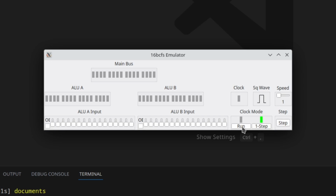All right, Adam, hang on a second. You said that adding latches was bad. Adding registers was bad. Well, yeah, I did. Or at least I implied it. Here's the thing, though. I need to make sure that things happen on the rising edge. And in this case, the state of the clock is actually a 1-bit wide register that needs to be latched with the rising edge. That's really the only valid time that that state can change.